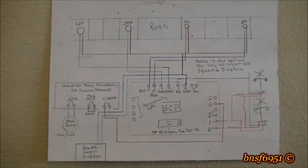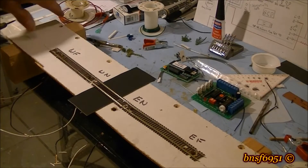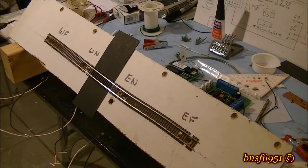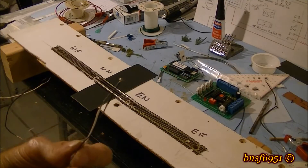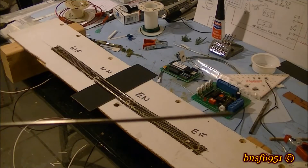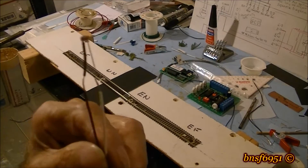Here is the beginning of my mock-up for the grade crossing. I marked the sensors according to the electrical schematic, secured a piece of track, and drilled all my holes for the sensors. Then I soldered wires onto the sensors. Since I'm short on wire, I'm going to use a piece of rail as a bus bar for the ground wires — they'll all be common.